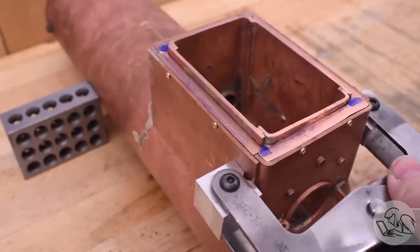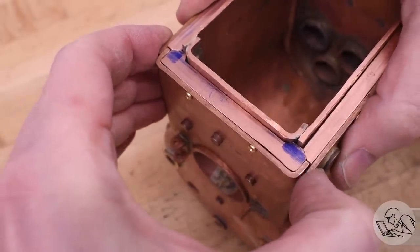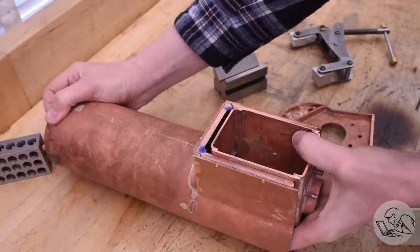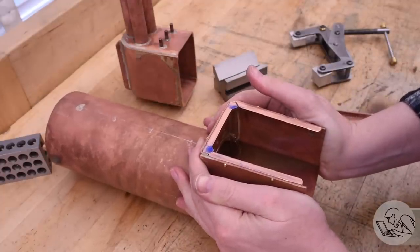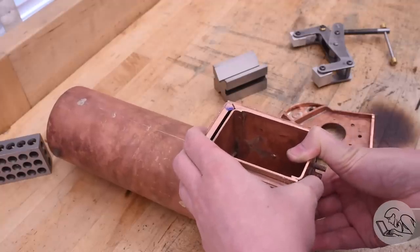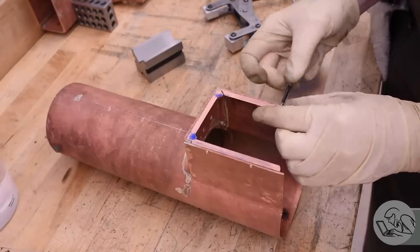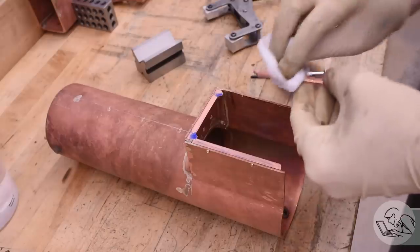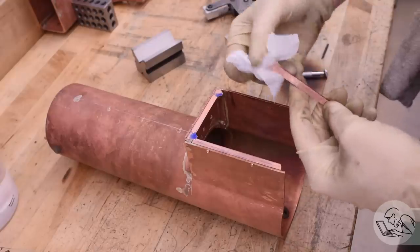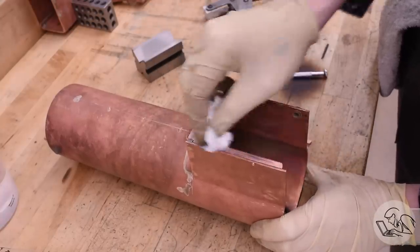I have a clamp on the back there because I needed it to hold this corner snug — I wanted to hold it in the position where I know it's supposed to be when I make all these pieces. I can take care of that right now by pulling the back head off and pulling the firebox out, and just give it a little squeeze there to correct the flaring on that rear corner, then put the firebox in one more time just to make sure I've corrected that. Everything has to sit perfectly on the fire door ring with no mechanical enhancements, because it's going to get soldered standalone by itself and has to fit perfectly after that. I'm cleaning all of the Sharpie marks off with IPA because pickling acid does not remove Sharpie marker, and that would interfere with getting good solder joints.